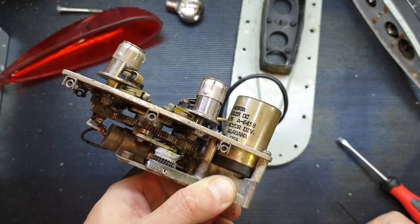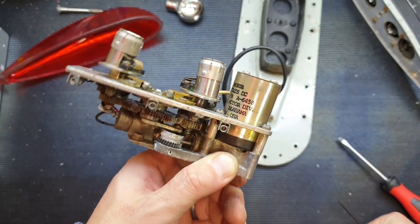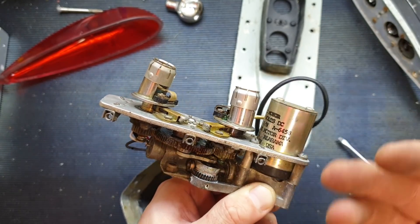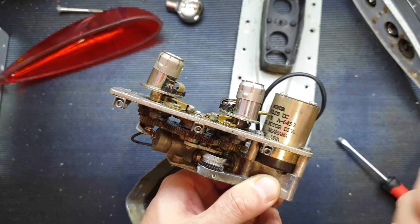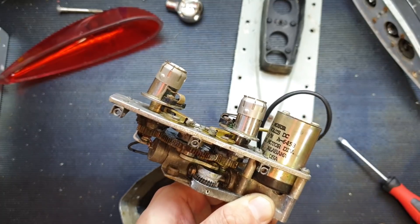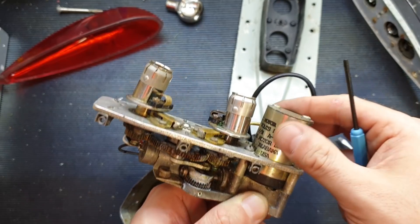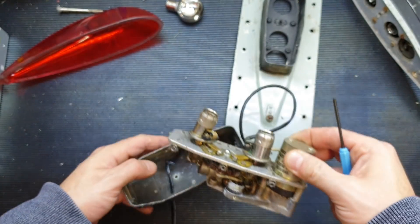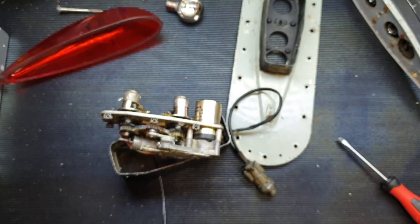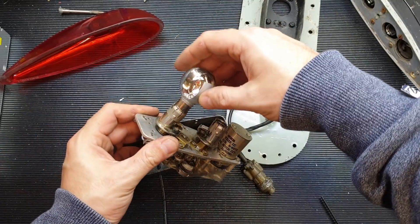That basically transfers the current to the outer shell of the bulb, much the same way as a commutator does on an electric motor. So it works - it's not over-engineered, it's been engineered to fulfill a purpose. At the time there was nothing else you could use to move two bulbs to give that desired effect. They had some solid-state stuff of course, but in terms of LEDs and high-output LEDs, they just didn't exist in the 1950s and 1960s. Hence this arrangement - but I think it's pretty cool and quite an interesting thing to take apart and see how it functions.